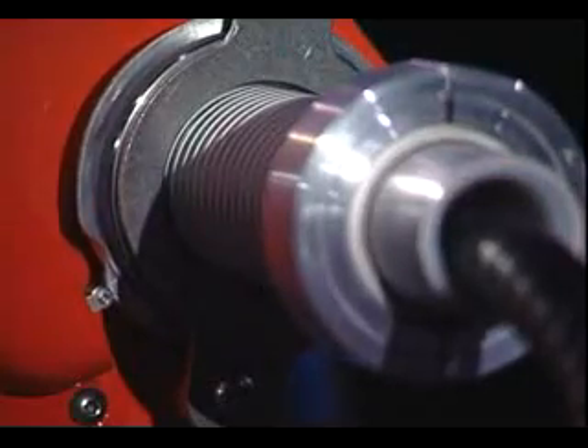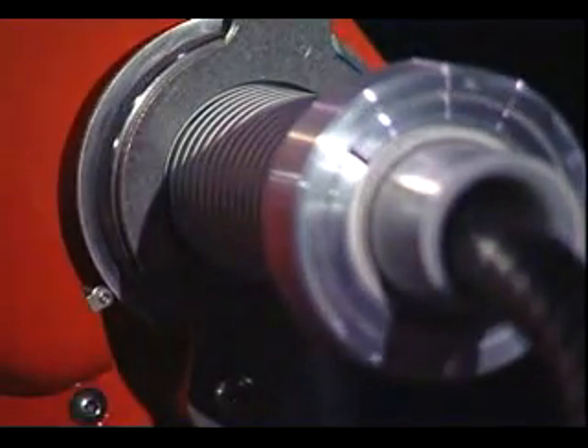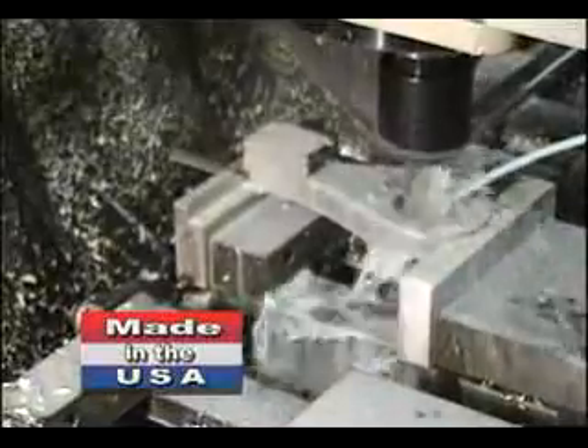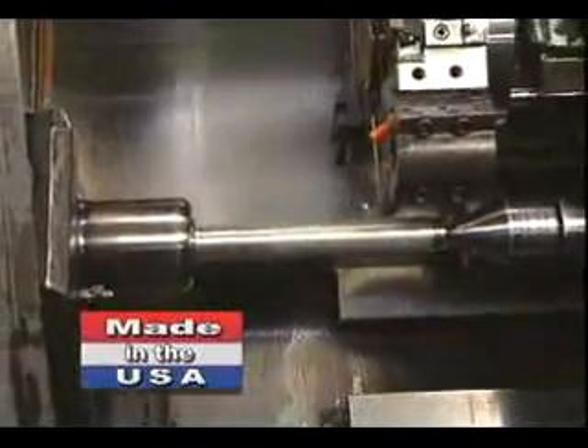Auto weld skip is a standard feature on the 450HD and comes as an option on the 308i. The BOA 308i's fixed mechanical feed and the 450HD's variable mechanical feed ensure accurate weld bead placement every time. Incoming voltage fluctuations have zero effect on Bore Repair System machines' feed rates. System components are machined to high tolerances with few moving parts — the BOA is an accurate and reliable addition to shops, mills, and plants.